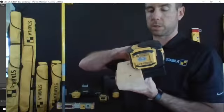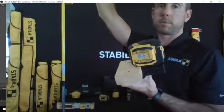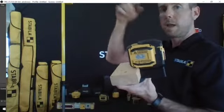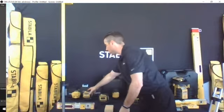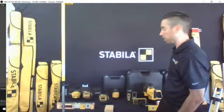And what that's going to do is it's going to split the bottom plumb dot, and your top plumb dot's going to generate out to a fairly substantial length, which will allow you to hoist your wall into place and plumb up a tall wall. Kind of in the same way that the spirit level product that we looked at previously, the plate level will work.